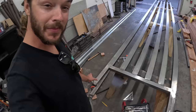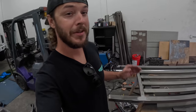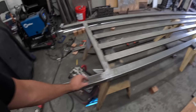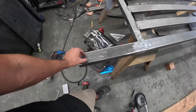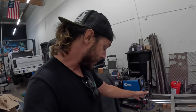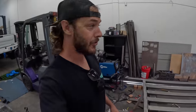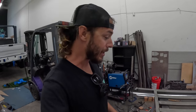I originally wanted to do them both two inches, but I did the bottom one three inches because I'm using a gear drive — it has a track with teeth on it that attaches to the gate, and I don't know exactly where that needs to be. Having a full three inches to play with down here seemed smart. I'm not going to put an angled support — I just think it looks better without it. We're going to load this up now, take it out to the ranch, pour some concrete, test fit it, and hopefully the gate motor shows up tomorrow.